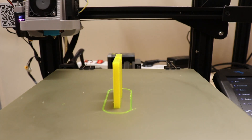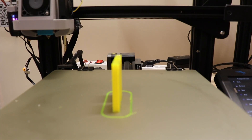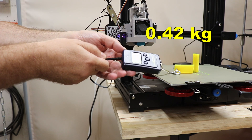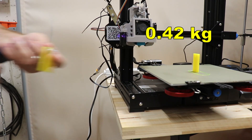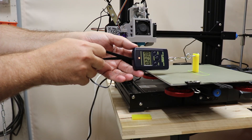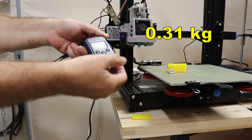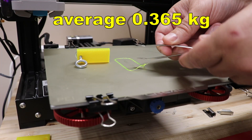Printing is finished and I will set the bed temperature to be the same. For some PEI sheets, PETG may stick too well, and using a glue stick is recommended — not to improve adhesion but as a separation agent. Now let's remove the skirt.